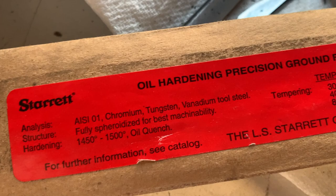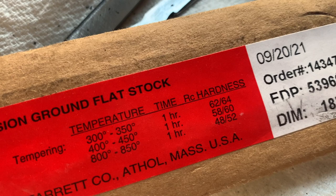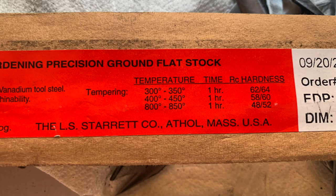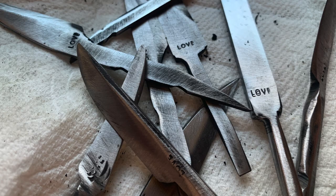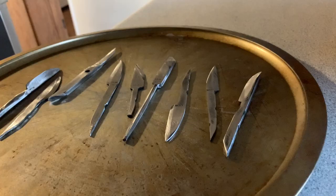Here's an up-close shot of the label that comes with the steel. You can see it has a chart for your Rockwell hardness and what temperature and duration to temper. We're going to go for 375°F, aiming for about 61 Rockwell hardness — anywhere around there is pretty good. Here are the blades after cleaning. I didn't clean them obsessively, and the smell wasn't too bad. I put them on a cheap cookie tray. We're going to put them in at a specific time.